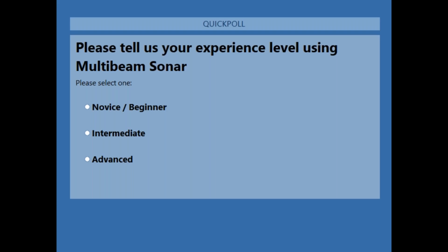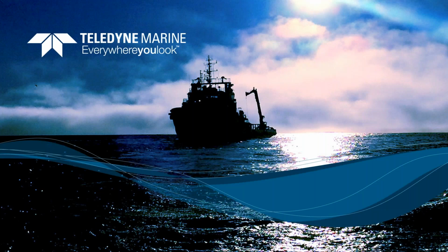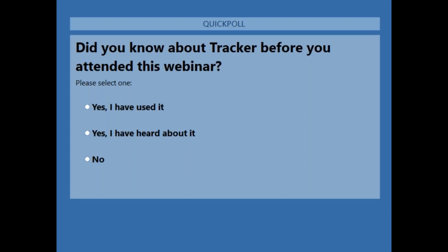There's another question here. I saw a posting about version 2 updates for the T50 recently. Does that include the latest tracker feature? Yeah, that's true. A couple of months ago we released a new firmware update for the T-Series, introducing some very exciting features, some of which were not reflected in this presentation. One of them was that we introduced normalized backscatter also for the T20. Until now, it's only been available for the T50. The version 2 update also increases the number of beams from 512 to 1024 beams, and there's an updated UI that sounds like it's unnecessary, but it really helps.